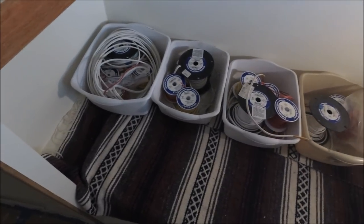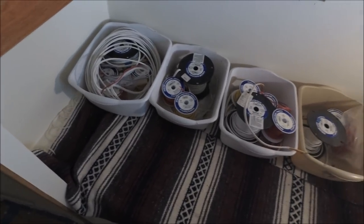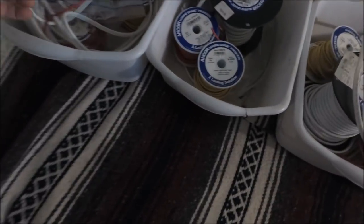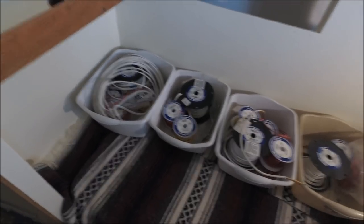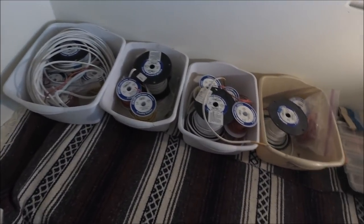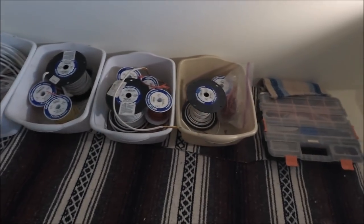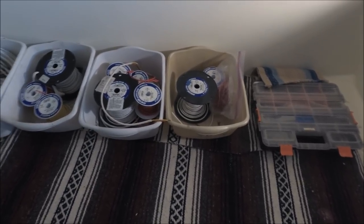Aside from the large battery cables, most of the wiring on this boat is going to be between sizes number 12 and 18 AWG. The 12 is the larger and we use that for higher currents — solar panels and 12 volt outlets and such. Then 14 and 16 are for general wiring that doesn't have high loads. And number 18 is for low amperage loads like compass light or single LEDs.